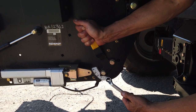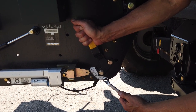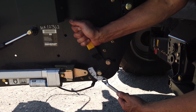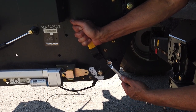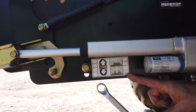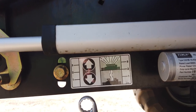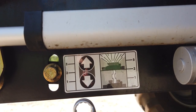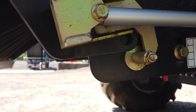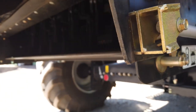The extra chop stationary knives are manually positioned by loosening the lock bolts on both sides and moving the knife lever up and down accordingly to achieve the required chop length. The chaff board also needs adjusting up and down depending on whether you are swathing or chopping. In both cases, locking bolts need loosening to make the adjustments, then tightening again before work begins.